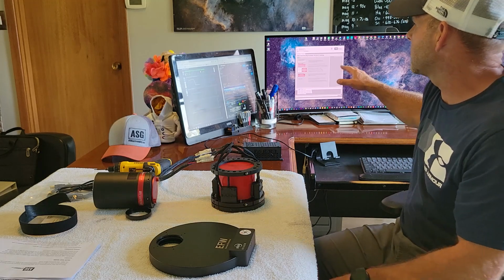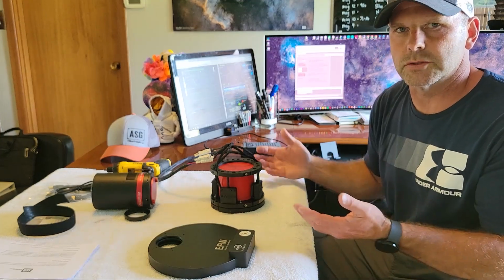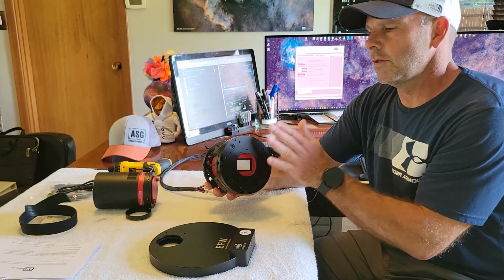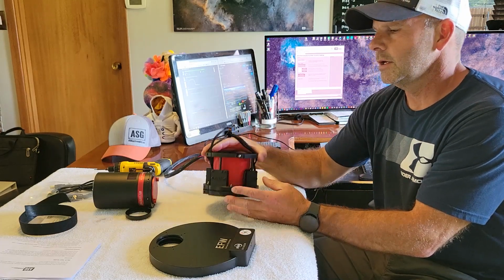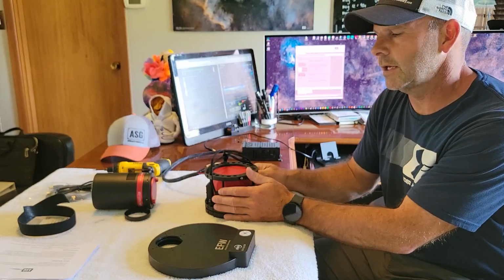And what that will do is go ahead and zero out all of the positions of the motors. So now you're ready to start again. And what you could do is another 500 move and move it back up 1 millimeter. And you know that's going to put you at that 3 millimeters plus the 1 millimeter to move the unit around. So, a couple options in the configuration panel to help you navigate the device.